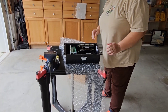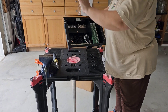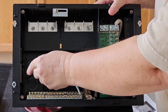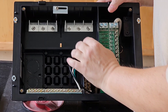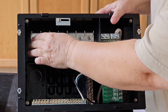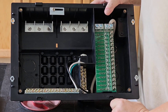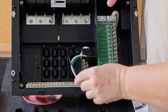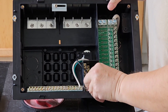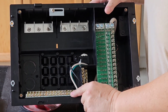He only has a 30 amp. This is the 8930/50, and what that means is you have two separate bus bars, so you could actually wire this to be either just a single 30 or two hot legs for a 50 amp service. But we want to make this a true dual bus power distribution center or breaker box, so what we need to do is separate this neutral bar.